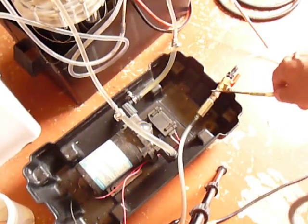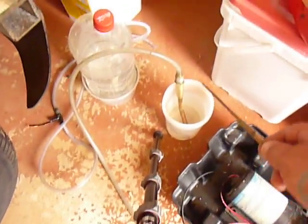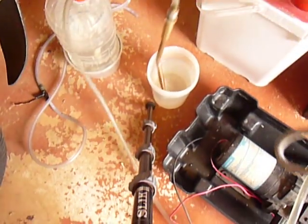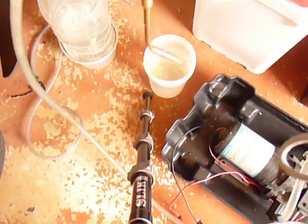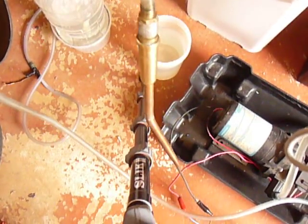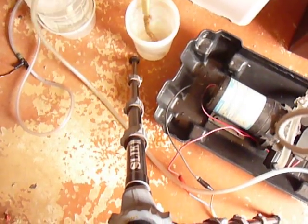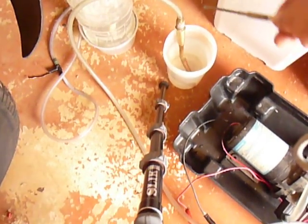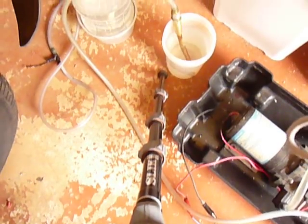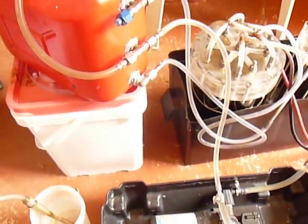I think the bronze wool is from a microwave oven. Then we've got it going into the final solution — a cutting torch. That's a cutting torch with just the one inlet for the HHO gas, sitting in a pot of water as a final safety measure. That torch also has bronze wool stuffed in the end, so there's another form of flashback protection. I'm happy with the flashback protection overall.